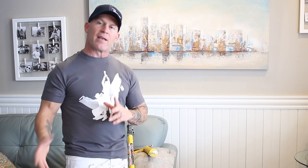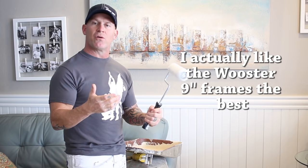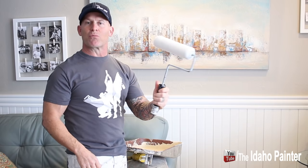You've got to have something to roll your walls. The next item is a roller frame and cover. You definitely want to purchase a good contractor roller frame. The reason you don't want to buy cheap ones is that a cheap frame will flex when you're rolling your wall. If it flexes and bends, you can't put enough pressure on the roller to get paint down into the texture, and it will leave trailing edges or lap marks because the pressure bends it and leaves a heavy edge. Always invest in the best nine-inch roller frame you can get.